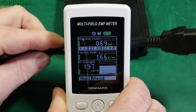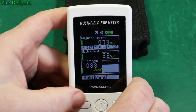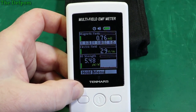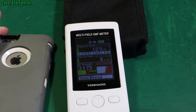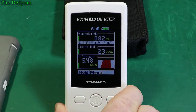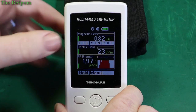Let's get some electric field readings. If I had my cell phone here I could show you the other stuff — I'll go get it. Okay, so here's my cell phone. I've got it sitting next to the meter, and you can see it's reacting quite nicely. Cell phones pulse the output on and off, so you will see it come and go — that's how they work.